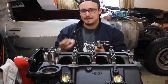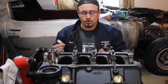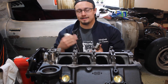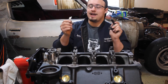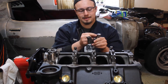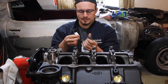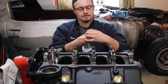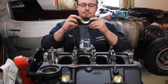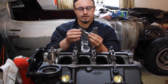The first step in this process is actually installing your bearings in your main bearing caps. Now if you've already done this or you're checking the oil clearances on an engine that's already put together and you didn't swap out the bearings, that's fine — you can skip a little bit ahead. Basically there's a little groove inside the main bearing cap and a small metal tab sticking out on the bearing itself. What you want to do is line those up and then just push the bearing inside so that it lines up properly. You want it to be flush on both sides of the main bearing cap and make sure that tab is aligned. And there you go — simple as that.